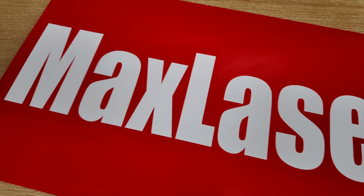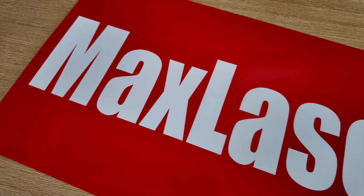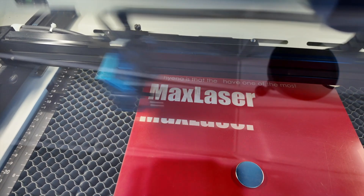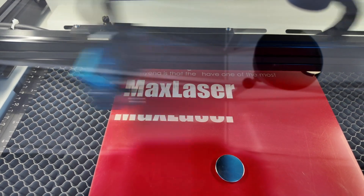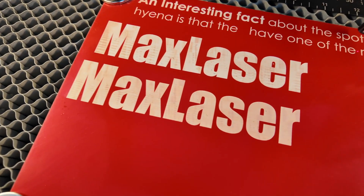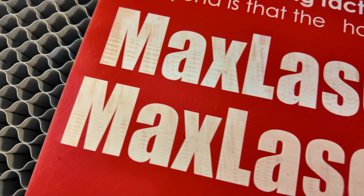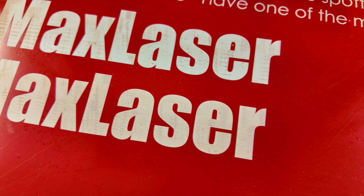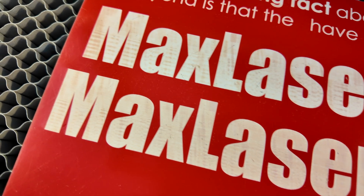Here's the end result - you can see the sign is really nice. The text engraving is very clean with no lines and very white. This was my initial start when I first began the engraving - I had it on autofocus, and you can see that autofocus was not giving the best result. You can see the lines and the contamination of the colors.